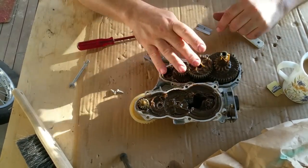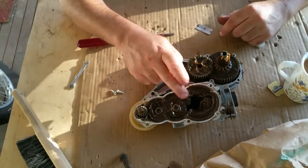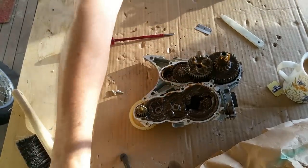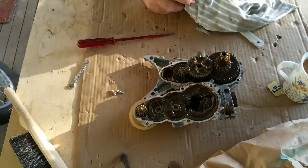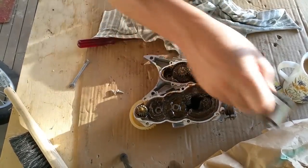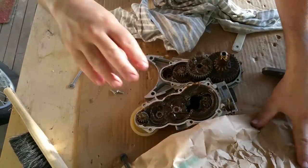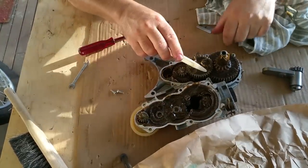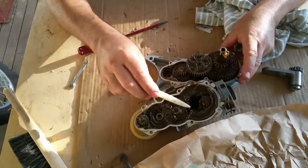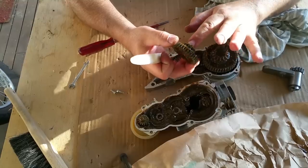Right, so that's all really wet, this grease. So, yeah, I think it was working down the shaft and out into the mixing bowl, which it wasn't quite getting in, but I think it was working its way down here and coming out where the fitting goes. So I'm just going to pop that to the side and start cleaning the stuff out. I'm looking for thrust washers. There's bound to be some somewhere. But this all has to come out. Now, interestingly, there's not one there.